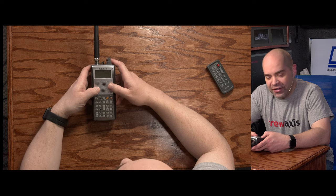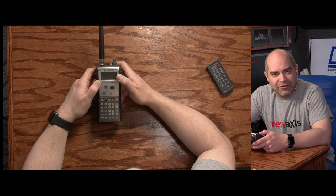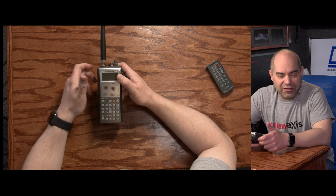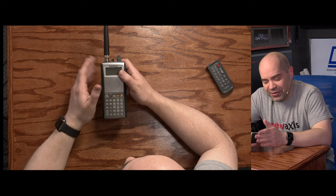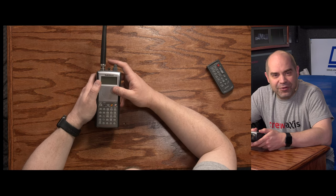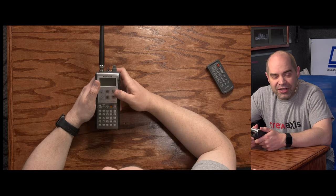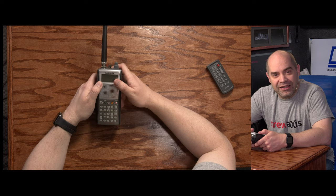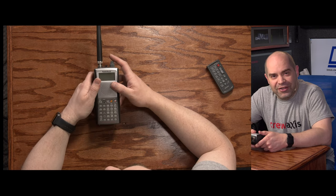Speaking of radio frequency signals, another handy device is a handheld radio scanner. This is an old one I've had for a very long time from Radio Shack, but there are many brands out there. These are great for actually listening to the signals you see on your RF spectrum analyzer. If you're going to get one, make sure it covers the radio bands you'll actually be using. A similar device is a software-defined radio, or SDR — those are very cheap, easy to get on Amazon, and do cover the bands used by wireless microphones, allowing you not only to see what's going on with radio frequencies but also to tune in and listen to the audio present there.